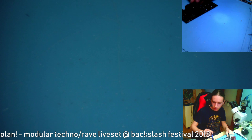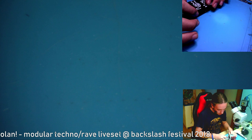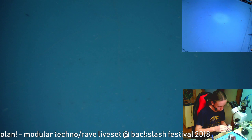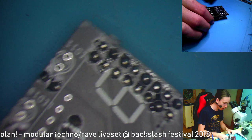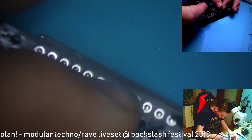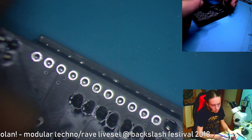Now I wanted to use those different pins, but as I said, they are not tall enough, but they are used in my clock divider. And they are cool. I hope I haven't made the same mistake as I did with the clock divider, where I flipped the connector upside down on one board, because I would have to order new PCBs.